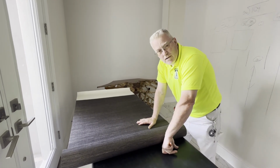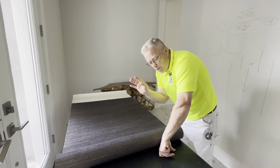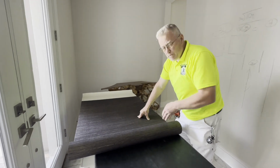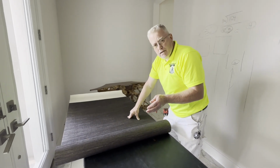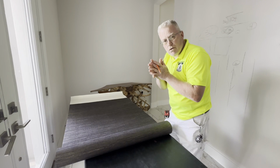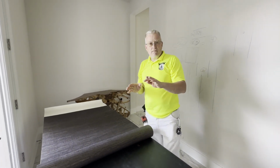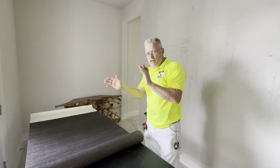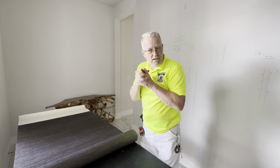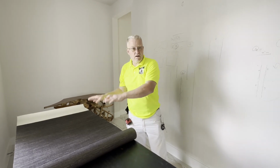It looks all the same, right? But it's not. The B side is always a little different. You see, the A side is the left side. The B side gets the color applied at a different time, from a different angle. The consequence is something called shading or paneling. Google it, and you'll see that when one sheet is put up against another from the same roll, it looks very different. I'm going to explain that. Just think of the A and the B living in two different parts of the wall covering.